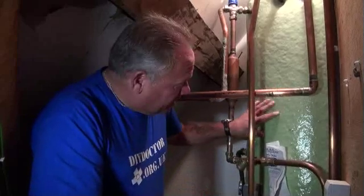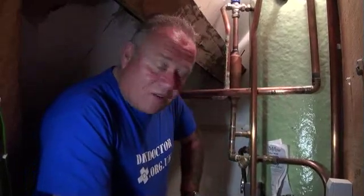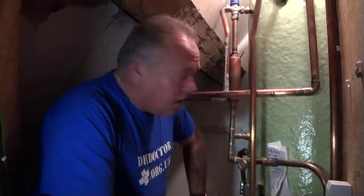In a thermal storage unit, this 250-litre tank works the other way around. The central heating water fills the storage tank — the thermal store — and the mains water from the domestic cold supply is passed through this cylinder in a coil and is heated, so that it goes to the hot water as well. So you have mains pressure hot water.